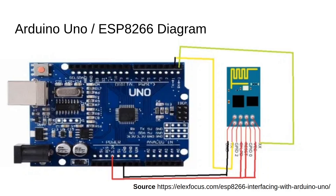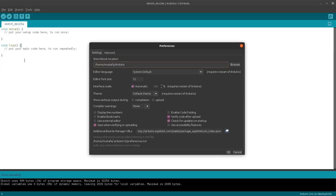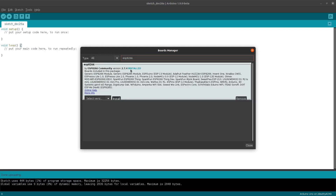Now let's introduce the ESP driver and the ESP instruction set using the Arduino IDE. First go to File and then Preferences. Under additional board manager URLs, make sure that you add the URL which brings the driver for the ESP8266 — the link will be provided in the description of this video. Hit OK. Now go to Tools, select Board, then under Boards Manager search for ESP8266. This will bring up the ESP8266 community package; make sure that it is installed or updated if an update is available.